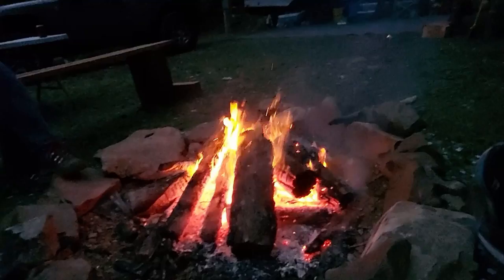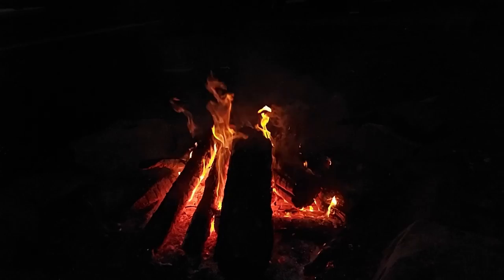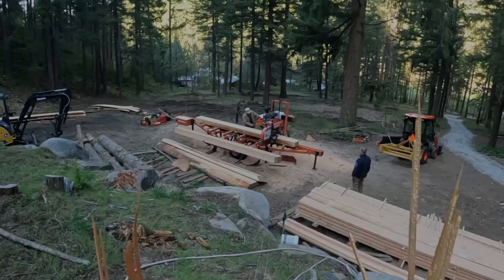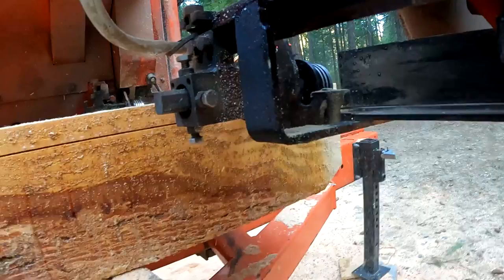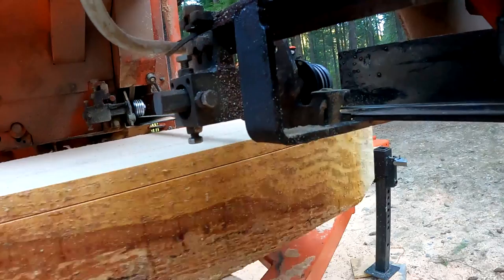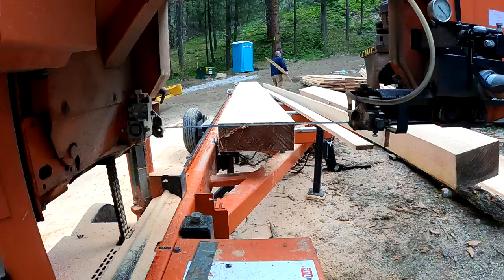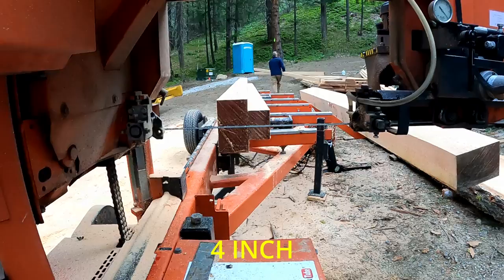Sat around the campfire that night, enjoyed a few adult beverages — it was really quite nice. Got started the next morning. We rolled up that four-inch slab up against the cant that was still on the deck and went ahead and started milling that down. The one thing I'm doing here is watching my grain — I want to make sure I'm not flat sawing. You might get to a point where it was time to go ahead and flip it up. We've got the right size cant — a six-inch and a one-inch. Just flip them up, clamp them together, and then start knocking it down.